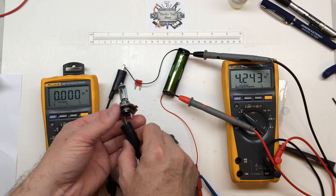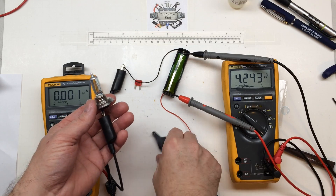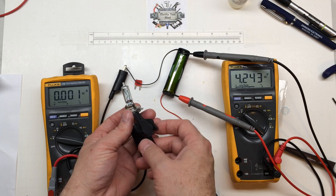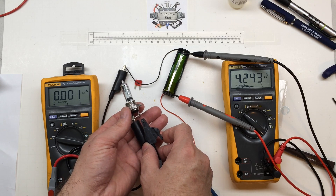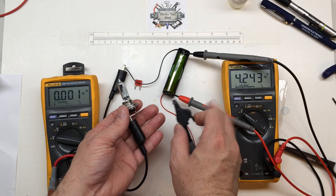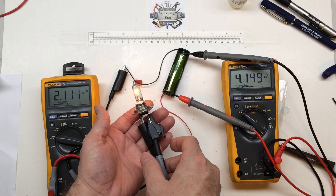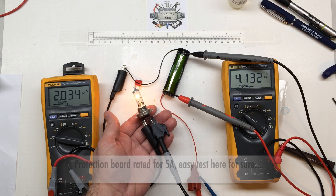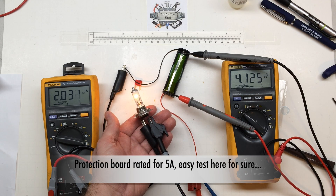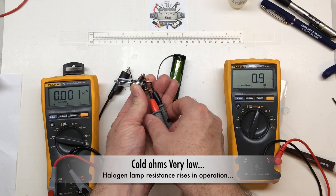After the short circuit test, I want to do a fairly low-resistance load test and make sure it handles continuous current. At about 4.2 volts it's probably around 2 amps. The current shoulder went to about 3 amps and came back down, holding at 2 amps fine. I don't expect more than 2 amps through it anyway. At fairly low ohms, it didn't pick it up as a short — it just ran it. That's good.